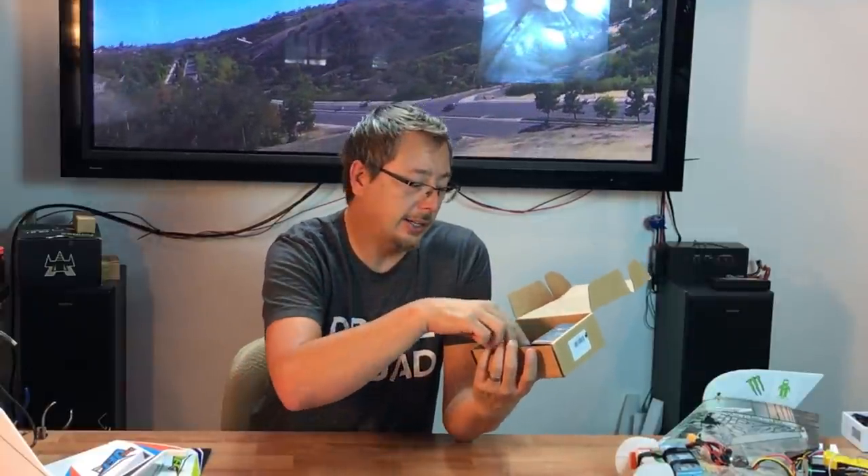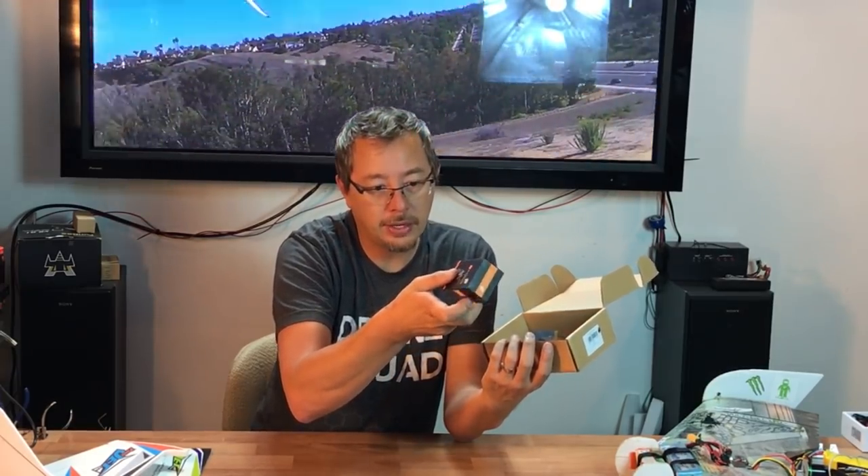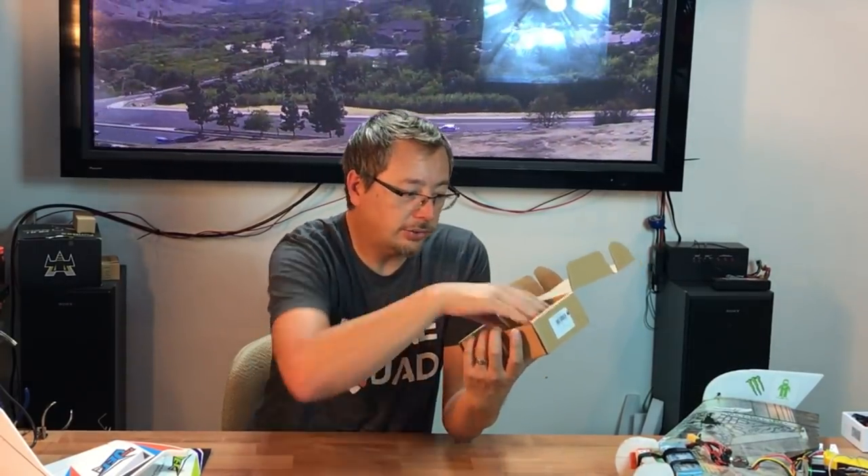This looks like the flight control board, so this is mainly a kit. Here's your motor holders. This is a very big 600 milliamp 7.4 volt battery pack. It comes with an FX798T micro video transmitter, some rubber bands and standoffs. This is the carbon frame for the Tiersen 117.